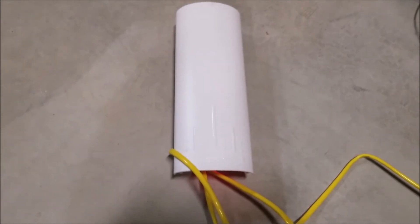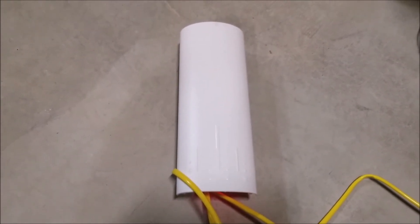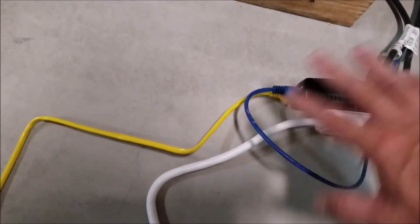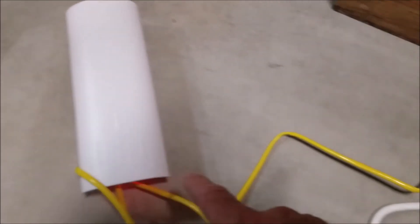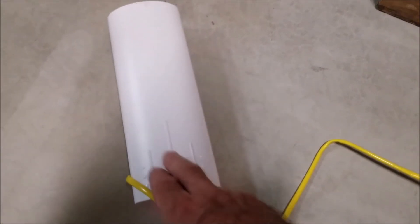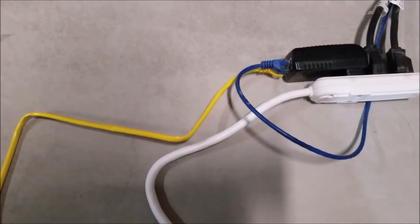That's basically what these units do — if you can't extend an ethernet cable to a second building or location that needs internet, this is the way to do it with a wireless bridge. On the secondary side, you could plug it into a hub to spread the connection to multiple devices in the other location. So if this is run into a detached garage, you'd plug the unit outside communicating back to the main house, then plug into a router or hub to add internet to the garage.